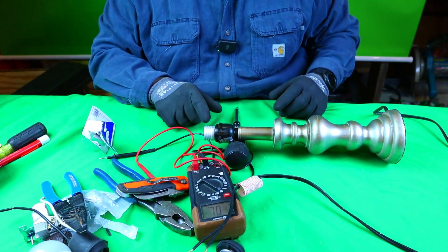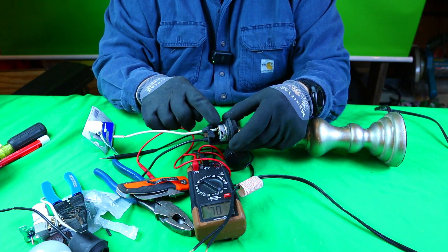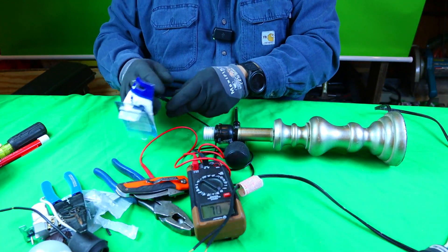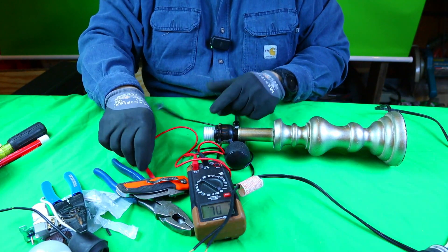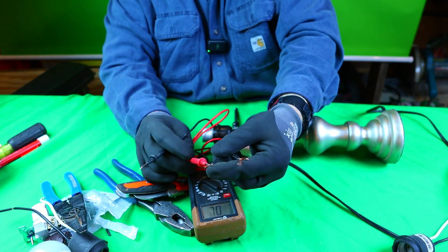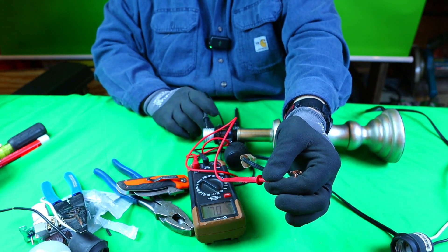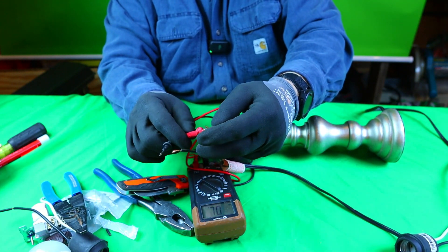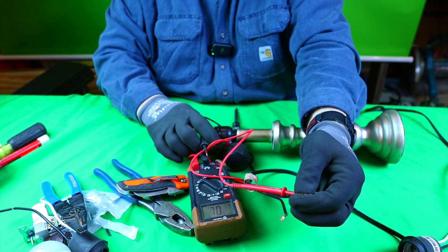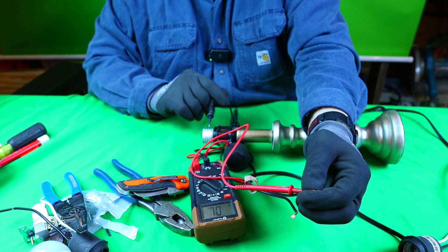Now we know that this is the rib part, so we're going to double check and make sure that that rib does go in here to this neutral. We'll unscrew this and show you that this right here is the shell — the same kind of shell that is in any kind of light that has one of these holders. So let's put our meter on it. It doesn't matter if it's the black or the red. We'll take the red and put it to this one. We'll see if it beeps through. It doesn't read through. Let's change it out and do the other side. That's perfect. Even if the switch here was off, it would still read through. The neutral always goes through because it's just going right here to the lamp shell.